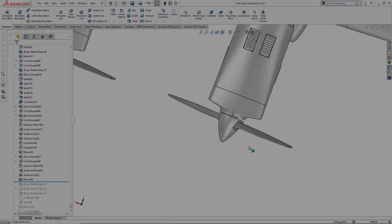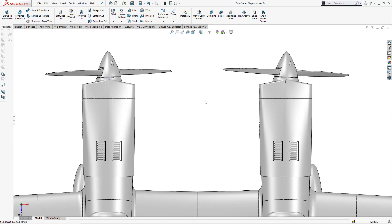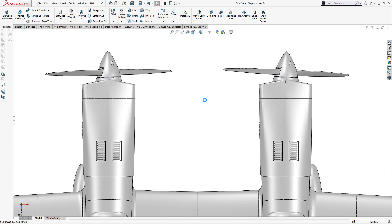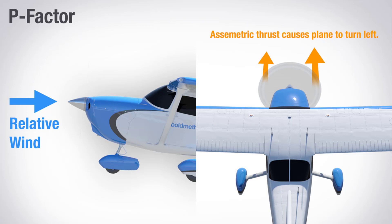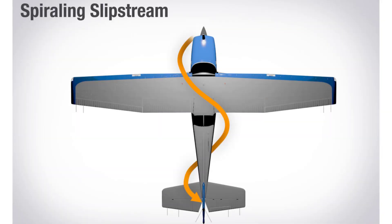The final major design change I made was to the thrust angle of the motors. Most single-engine RC aircraft have a few degrees of right thrust built into the motor mount to combat aerodynamic phenomena known as P-factor and the spiraling slipstream caused by the rotating propeller. The P-factor effect is most notable at high angles of attack, like during takeoff — the downward sweeping blade is at a much higher angle of attack than the upward sweeping blade, creating more thrust and making the airplane want to yaw to the left. Also during takeoff, the air accelerated behind the prop, known as the slipstream, follows a corkscrew pattern, wraps around the fuselage, hits the left side of the tail, and creates a yawing motion turning the aircraft left. So a little bit of right thrust helps combat these effects.